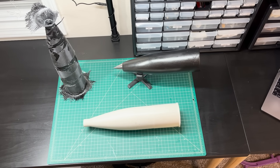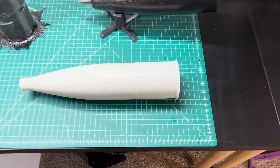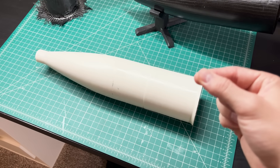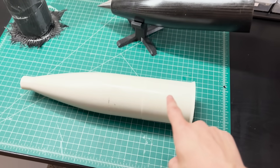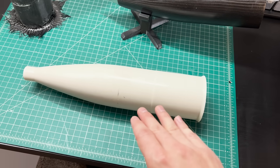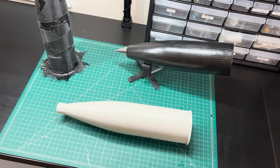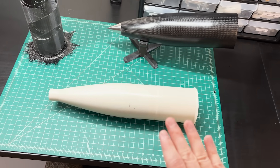Before we build our own nose cone, let's talk about how amateur rocket composite nose cones are traditionally made. Nose cones and other cylindrical parts are particularly difficult if you use an inner mold — where we have a mold and we're laying composite material around it. Because it's a giant cylinder, we can't peel material away, so we have to pull the mold out of the composite part when we're done. This means we have to have a very low surface friction coefficient between our mold and our final part.